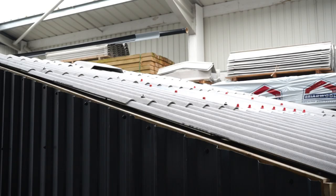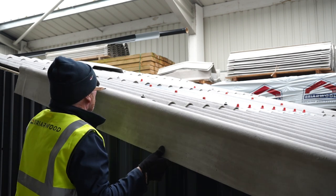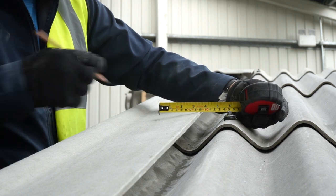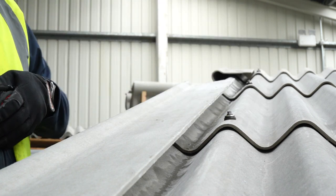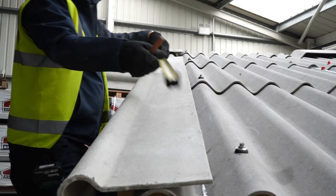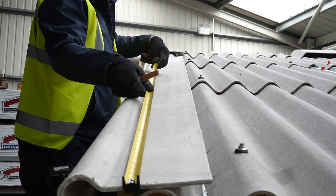With each type of barge board, one side will extend down the edge of the slope whilst the other side will extend across the fiber cement sheet. Barge boards should be positioned so that the lap is directly below the end lap of the sheets, with the top of the underlapping barge board close to the bottom of the sheet in the course above. The sheet should extend as far as possible under the barge board to ensure a weatherproof junction is provided.